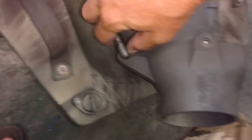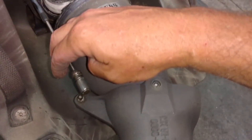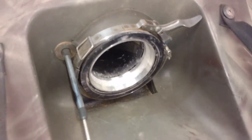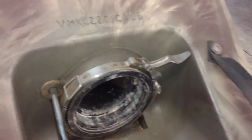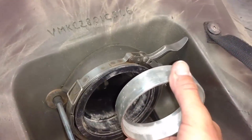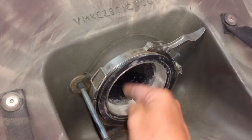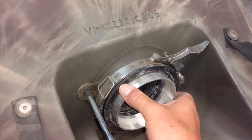This is your wear ring. You don't have to disconnect this — just take the pump loose from the motor. But I'm going to take it out so I can pull the pump out and show you some stuff. Here you have your wear ring. The factory one is plastic and you have to beat it in and out. Now, this is my aluminum one, and all you have to do is just slide it in place by hand. No tools required, and a simple twisting motion is all you need to get it out.